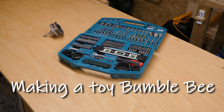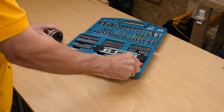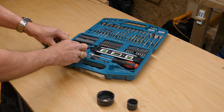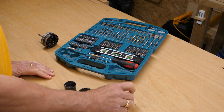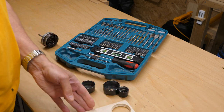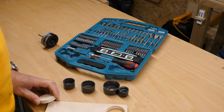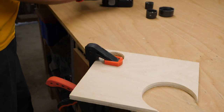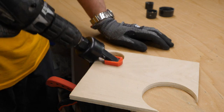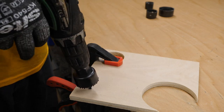We're going to need a set of hole cutters. I've got a couple of options: I've got this adjustable unit or I've got these fixed size hole cutters, and I think I'm going to use these. I've done a test run and cut a circle out and it works pretty well. I've got the piece of wood clamped to the bench, the bit in the hole cutter in the drill, and the trick is to start it on one side and then finish it on the other.